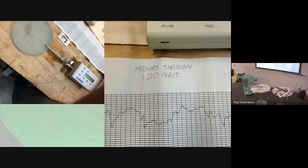What's unique about that optical system? Well, first of all, it's supposed to have no coma, no spherical aberration, no nothing, and a really big beam. Second thing is the two pieces of glass in front are identical. So they could be whatever glass you want, just the same. And the curvature number one is convex, and that's the same as curvature number three, which is concave. And curvature number two is the exact opposite of curvature number four. So that's the special thing.